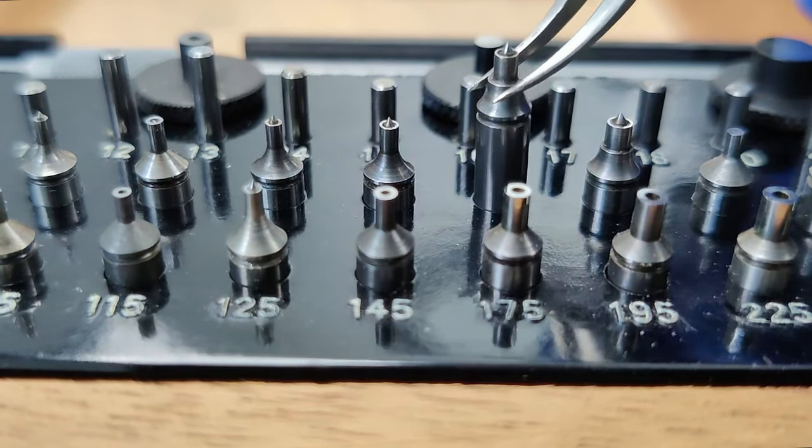I'm going to slide the third wheel into place. After oiling the barrel's lower bushing, I can install the mainspring barrel. And here comes the center wheel. Applying some DX grease. I'll apply some DX grease to the winding arbor where the sliding clutch slides down. And I'll do the same for where the winding pinion slides onto the arbor. And we can get this set into the main plate now.